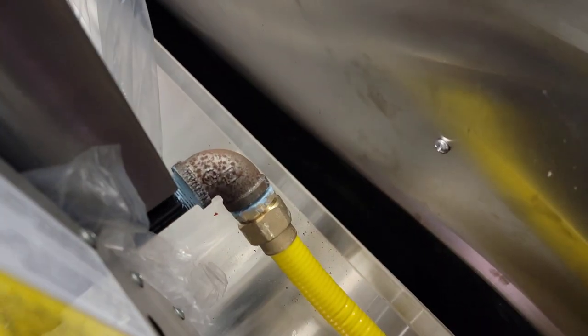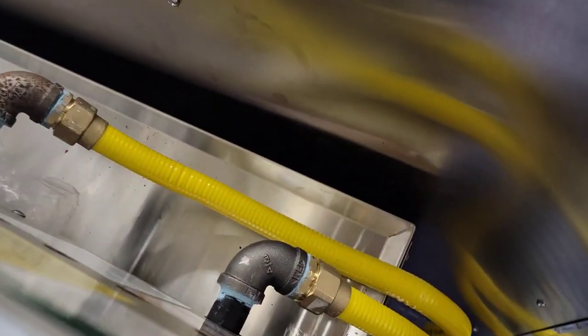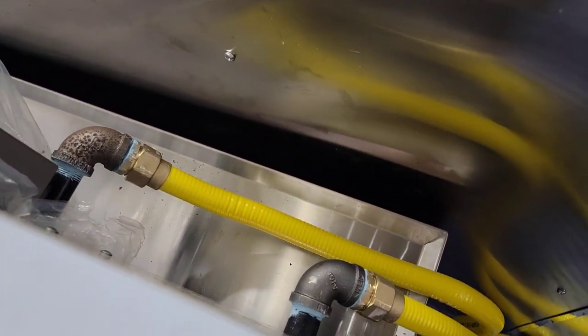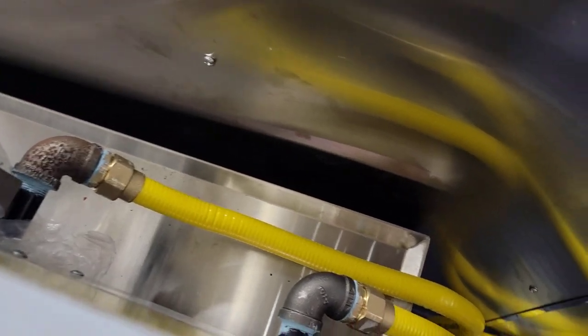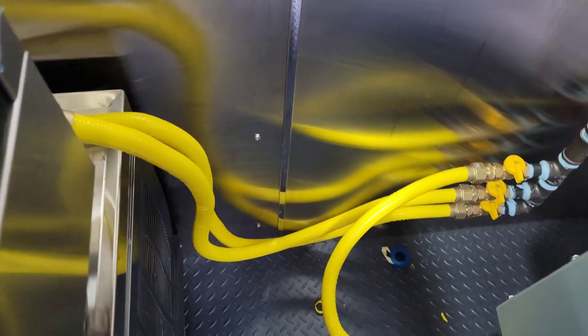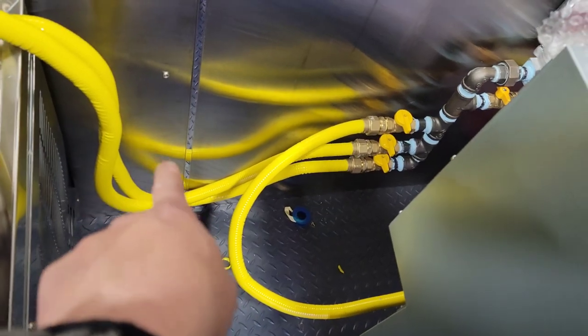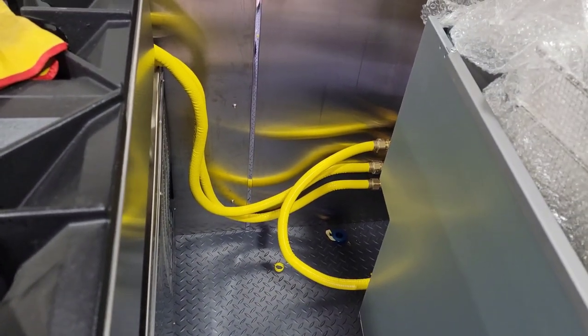Let me show you the progress. There's that 90 — I came to the right instead of kicking it out the other way, which would use a lot of flex hose. Same thing on this side, I came right. You can see the griddle and the burner here. I ran the flexible hoses right back there — one for the burner going to the middle with a shutoff valve, one for the griddle on the bottom, and one for the fryer on top. That's how this manifold contraption looks.